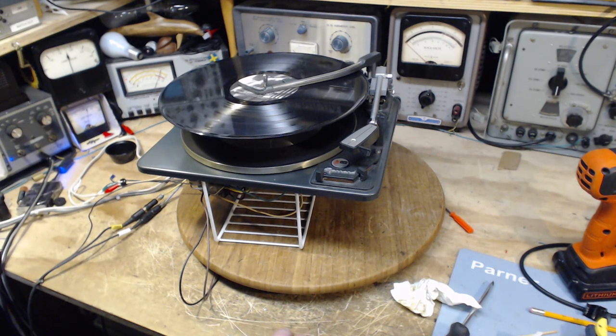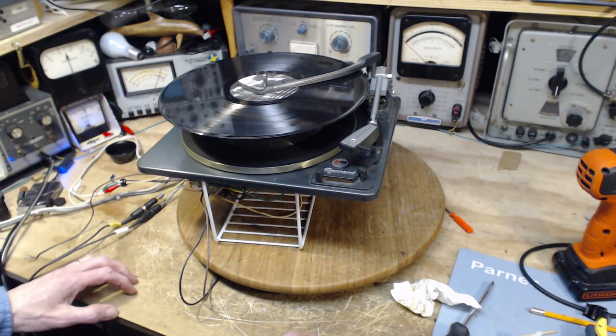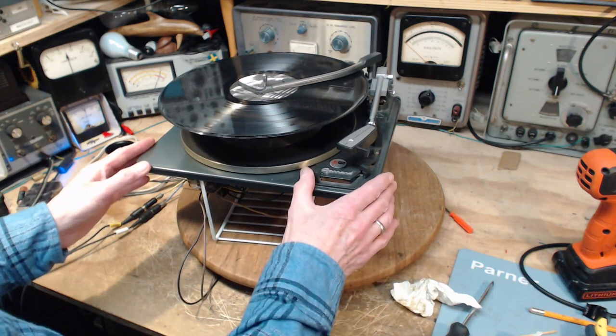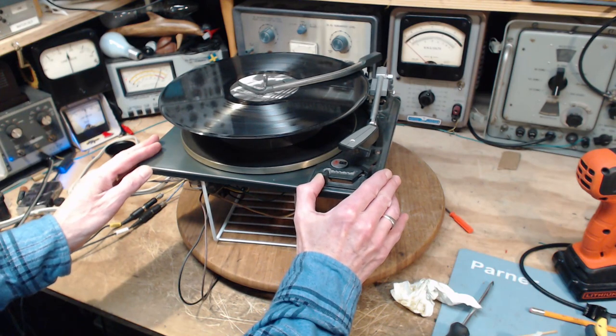Now, the next thing we're going to do, I'm going to turn the volume up and listen for hiss, hum, and stuff like that. Okay, well, there's definitely a hum, but the volume's up quite high right now, I believe. So we'll back it down. Exactly where that hum's coming from, I do not know. I do not have the ground wire connected to anything, so maybe it's that. Let's see, does it work? Put it on speed 33. Power switched on. Manual first, just manual.